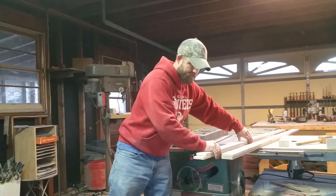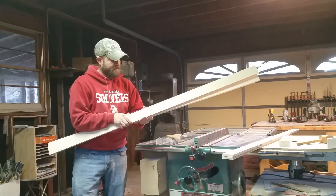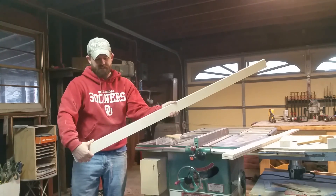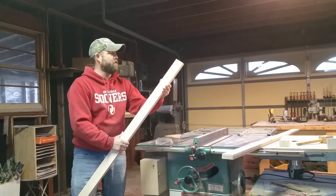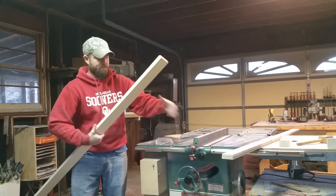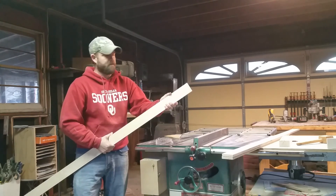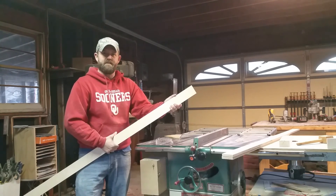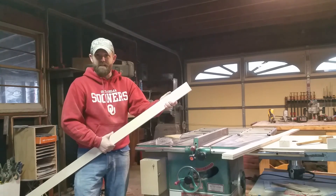There we have it. I'll look at the prettiest figure on each side and mate these back together as close as possible to keep them even, because the less work I have to do sanding them down and getting them perfectly flush, the better. I'm going to glue up two pairs and after they dry tomorrow we'll shape them and get them cut. We're getting close to the finishing part, but it's getting cold in here today so I'm going to call it a night.